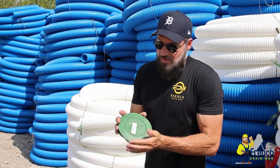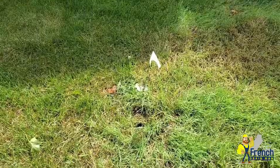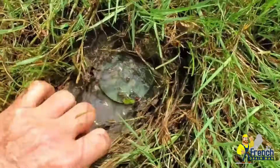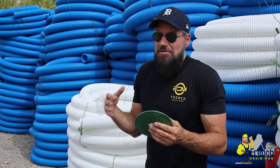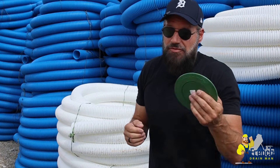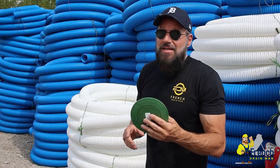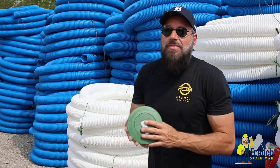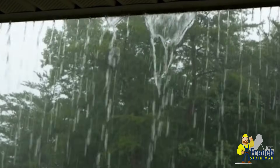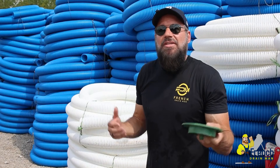Another thing that used to frustrate me — these are really tiny. The grass grows over them in a minute, and that's a problem because then you lose them. Now your underground buried downspout system is not daylighting. Your water has to be taken to daylight — you can't lose your water underground. Nine times out of 10 you're going to a pop-up emitter, and it needs daylight. If grass grows over it, all that water is going to pour right back at the roof. Your gutter trough is going to fill up and you'll end up with a flooded basement or crawl space over a pop-up that the grass grew over.